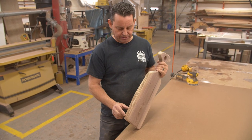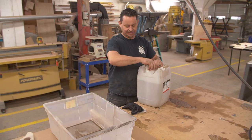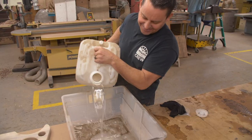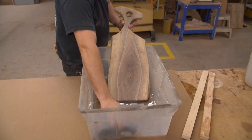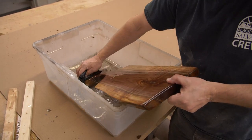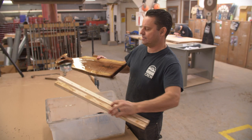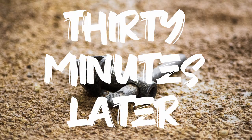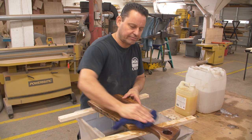It's nice and smooth — we got the edges smooth. I took some of the bark off but not all of it, because it looks really pretty if you leave a little bit. Now we're going to bathe it in mineral oil. The mineral oil is food safe and it's going to give it a nice coating. Basically the wood is going to suck that oil up and it's going to protect the wood. I'm going to take a rag and just soak this thing. Once it's nicely coated, we'll put a couple of sticks under it and let it sit and soak for about half an hour. As you can see it sucked up quite a bit of the mineral oil, but there's still a little bit left, so I'm just going to rub that off with the rag.